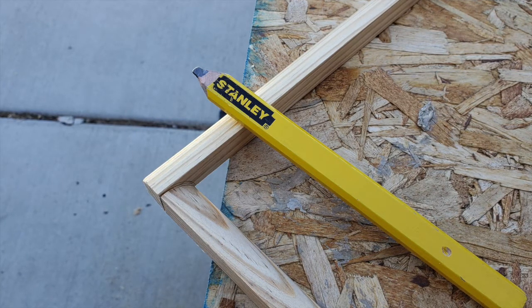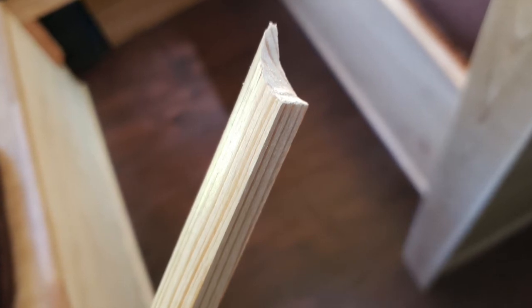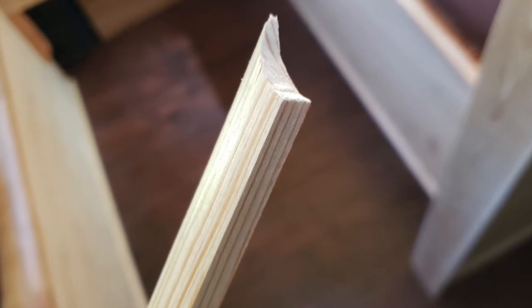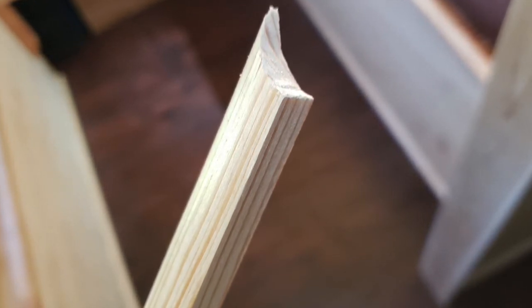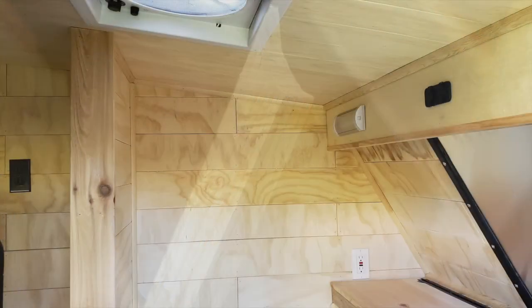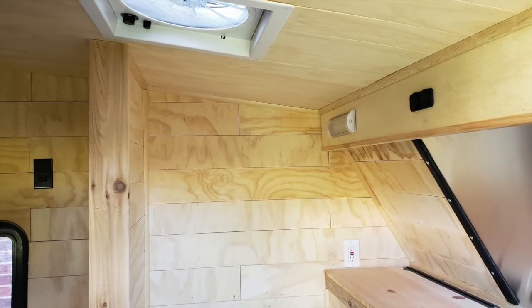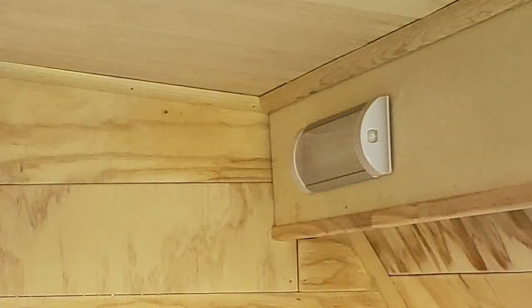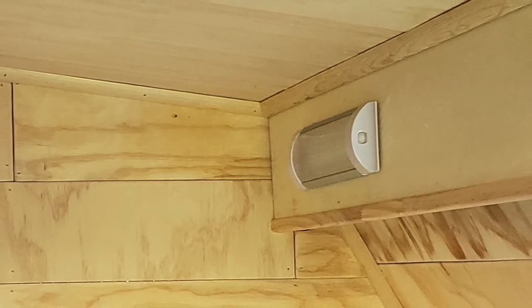That type of joint is a lot more forgiving. After cutting with a coping saw, it creates a rounded end and this makes it a lot easier to cover up those compound angles. It's not a perfect cut, but I'll just get a wood rasp and clean it up a little bit. Working my way around the top side, and I've got this section of the camper all completed. Here's a closer look — you can see that using that method actually works out pretty nice.